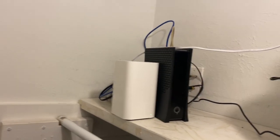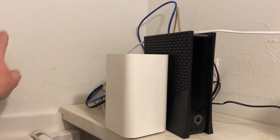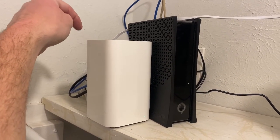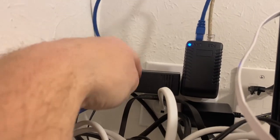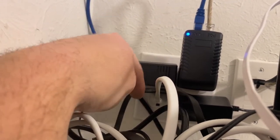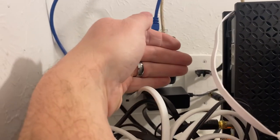On this install I went a little overboard, I'm not going to lie. I decided to move my modem and my router into this closet. They used to be on the other side of this wall down on the floor underneath my computer desk — the cables were everywhere, it was a mess. So I went up in the attic, grabbed the coax, pulled it out of the wall, drilled a hole in the top plate, ran it down, and put in four plugs with a double-gang cut-in box, then put in another six-port cut-in box so I can upgrade my ethernet if I want to.